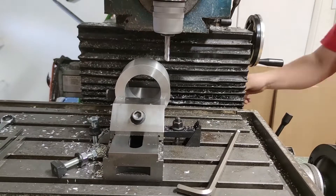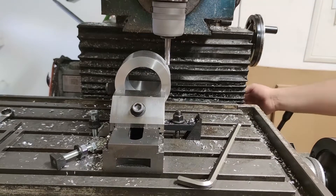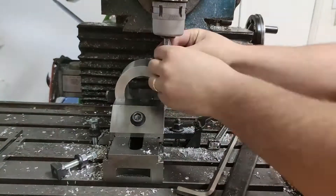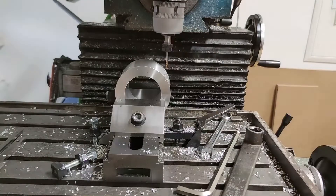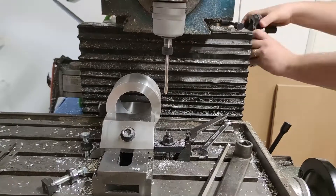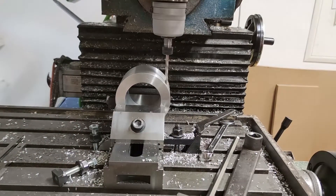I then clamped the back clamp in the vise of the mill and milled the counterbores for the screws with the end mill. I spotted the centers of the holes for drilling and drilled the first few millimeters with the bigger drill for screws to slide through. The clamp had to be slit with the saw, so the screws had to fit through the first part and then the hole needed to be tapped for M6 to accept the screws. So I used a smaller drill to break through the clamp.